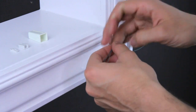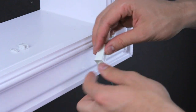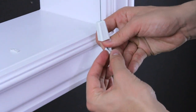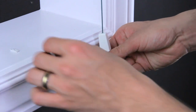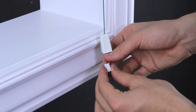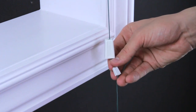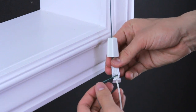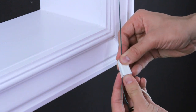For the three-part cord stop assembly, first slide the cover on. Attach the equalizer approximately two inches below where your shade should stop when it's lowered. Place the equalizer into the housing. Wrap approximately three inches of excess string around the bottom of the housing. Slide the cover down over the housing and trim off any extra string.